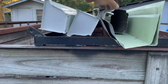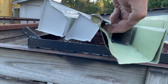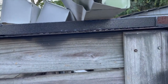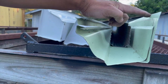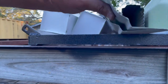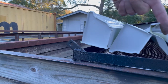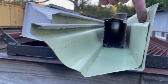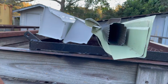That's what your gutter would look like on your house — put a hidden hanger in here, that goes across to the back, and then screw it down. By the way, this is the difference between five-inch and six-inch gutter. This is the five-inch, this is the six-inch all the way up to here — these are the bottoms of them. You can see the difference: about a good inch gap in width, about an inch in height on the front. That's the difference between five-inch and six-inch gutter.